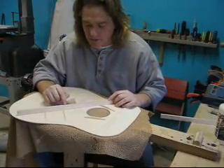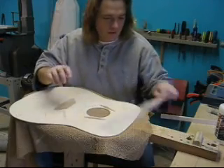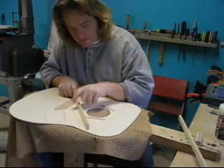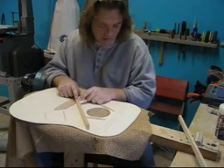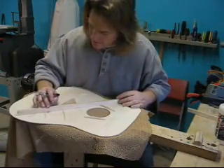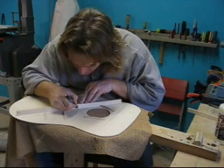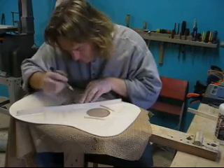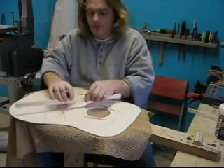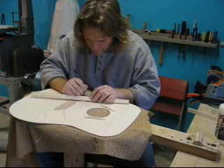Get one happy in place and redraw the edges of it just where the two are going to cross. I've labeled that one 'TD,' which is top down, so I know this is the top of it and this one's going to have the down notch cut in it. Then take the second brace and put it in place, making sure it fits, and redraw it — I've marked it 'top up' because it's going to have a notch knocked on the top. Then bring the other one back, get it lined up lengthwise, and mark on it where the lines are where the other brace is going to cross. Extend those lines onto the bottom of the brace and continue them across.